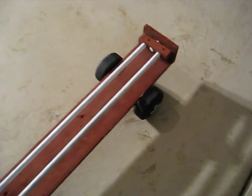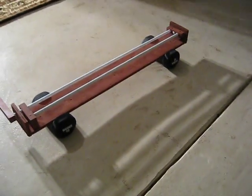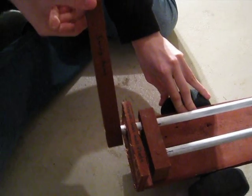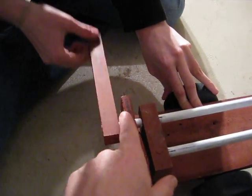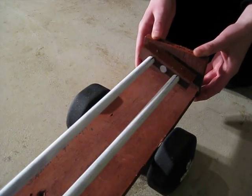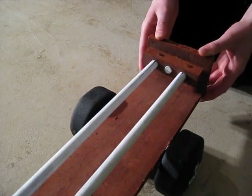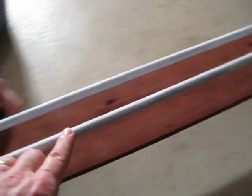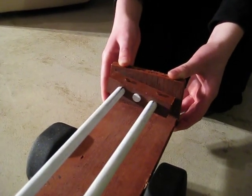Molly's going to have the block side, and this is Tori — she's going to work the swing arm. So Tori's going over some bumps here with the swing arm. The energy is going through this torsion bar and it's twisting, going all the way down to this block, and the block is pivoting vertically. The energy is going through here and causing this bar to twist because it's anchored right there — it can't move. That side's twisting.